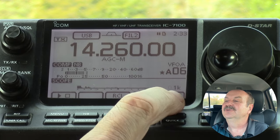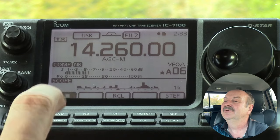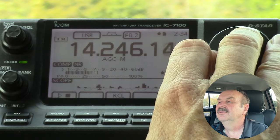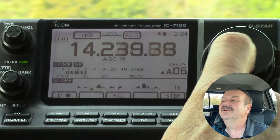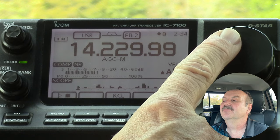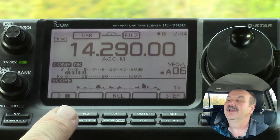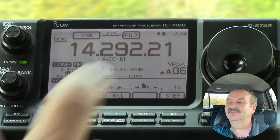We'll change the step size here to one kilohertz. This is only going to be 30 kilohertz down and up, so that's going to take us from basically 230 to 290. We'll do a couple of sweeps here - there's some signals. When that arrow gets to the very left edge, we should be at 230 or just about 230. There's the arrow right on that left mark and we're at 230. And up at the top mark we're at 290, so it's 30 kilohertz either way. If you keep tuning, the arrow just changes to a little blinking right arrow to let you know that you're off that side of this particular scan.